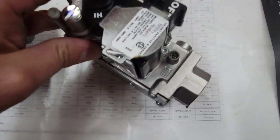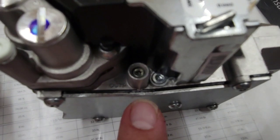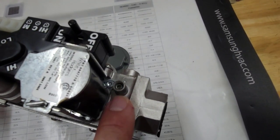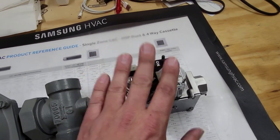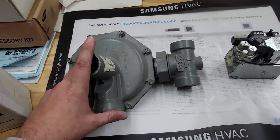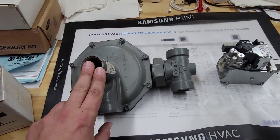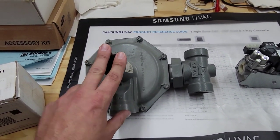This right here is a gas valve and you're going to see me check the inlet. The outlet says 'Out P' and this says 'In P,' and I only had three inches coming in and only about two inches coming out. On natural gas, we need to be burning at three and a half inches. I don't usually run into a regulator needing to be adjusted in the field.